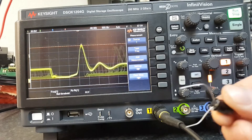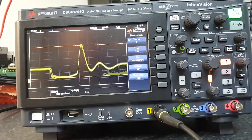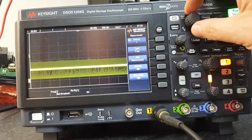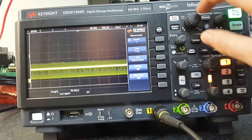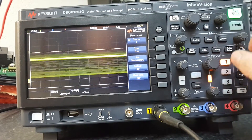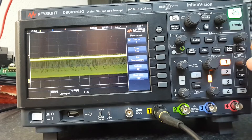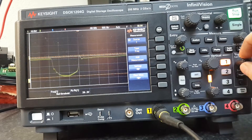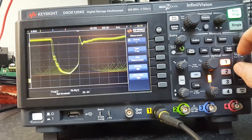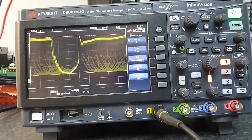So let's stop and I'm going to fit this little one-microfarad 400-volt capacitor. That capacitor should have no problem dealing with our 100-volt spikes. Something's changed - we have some capacitance in there now. Let me get the trigger level sorted. There we go - our high spike is all gone, everything's going to be just fine.